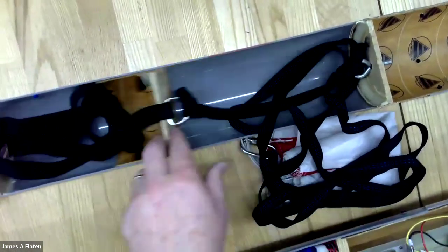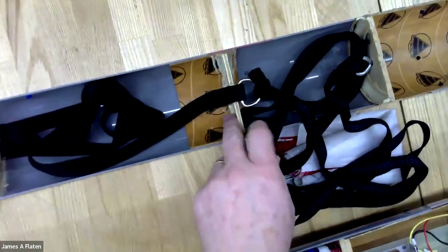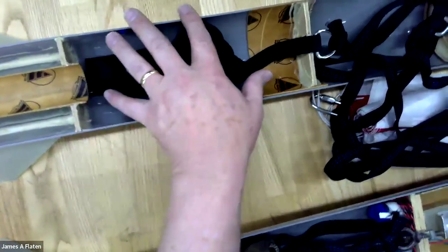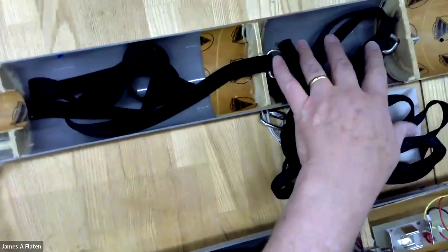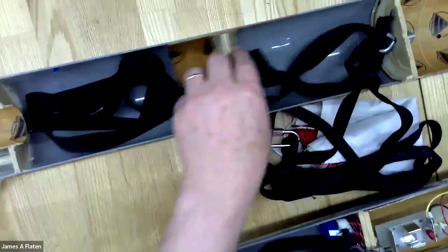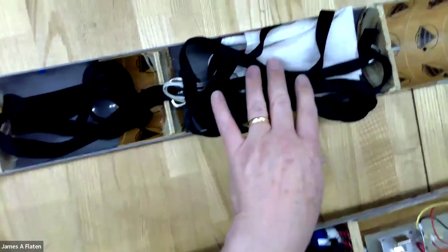And you can see this piston, which is a piece of coupler tubing, has a bulkplate here. And so the idea is when there's an explosion from the upper end of the motor, at this point, it pressurizes the bottom of the rocket, pushes the piston forward, and then the piston pushes the nose cone off and the parachute up here. But the piston actually serves to protect the parachute, so I don't need to wrap the parachute up in any flame protecting cloth or anything like that. And then here's the very base of the rocket.